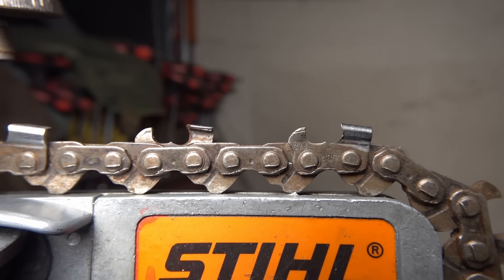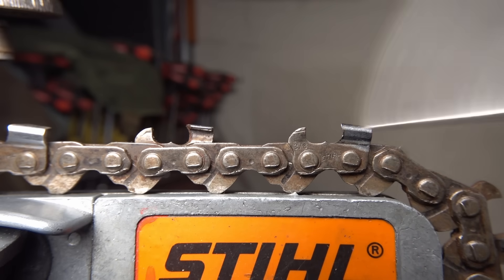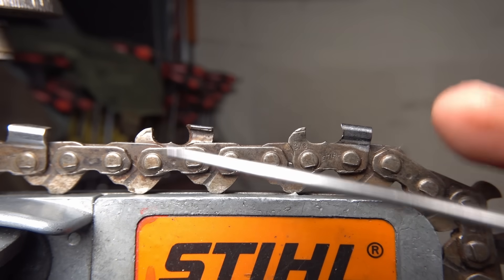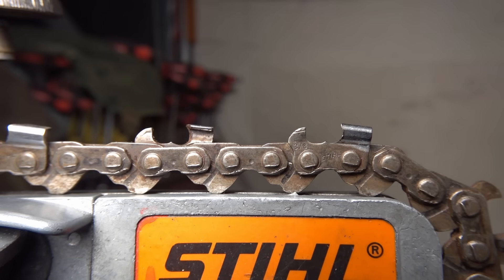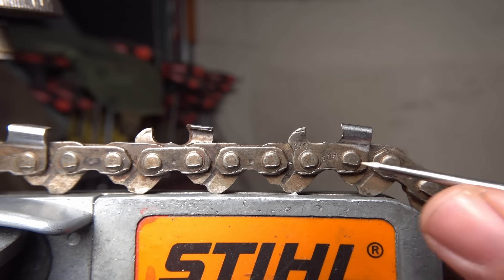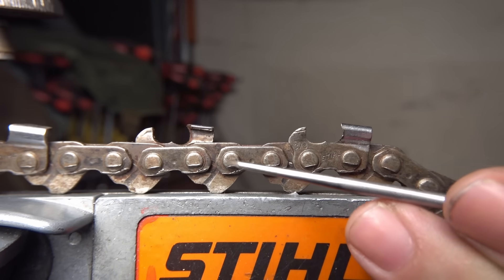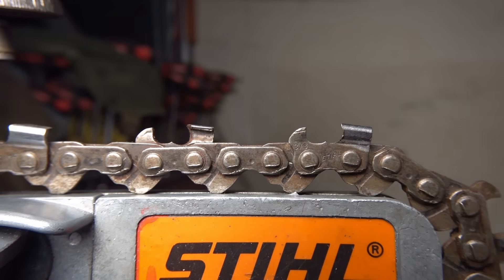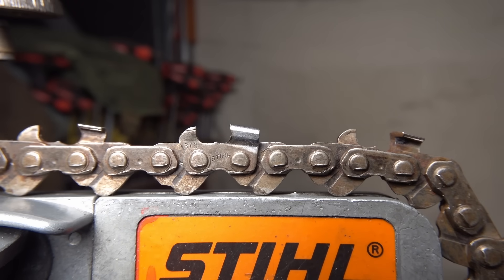This next one is very unique. There were issues with bar rail depth on the bottoms, but what actually killed this chain was a nose sprocket failure. If you look at all the rivets, you can see they've got a big gouge out of them about halfway up. This most likely happened when a nose sprocket failed and allowed the chain to drop down into the nose, splitting the end of it. I keep this one around because it is very unique — I don't have anything else like it.